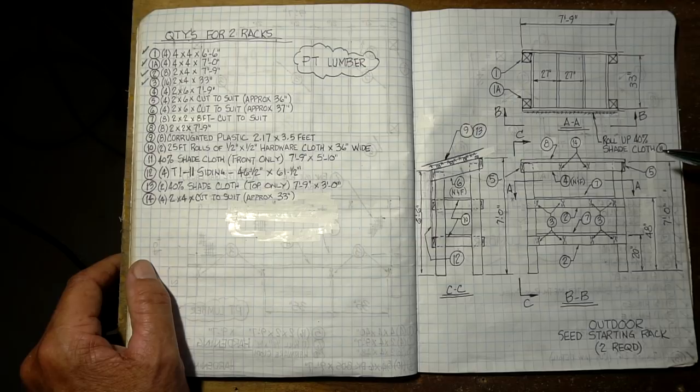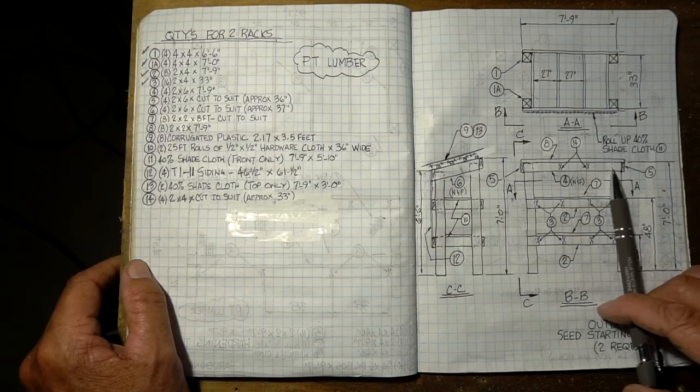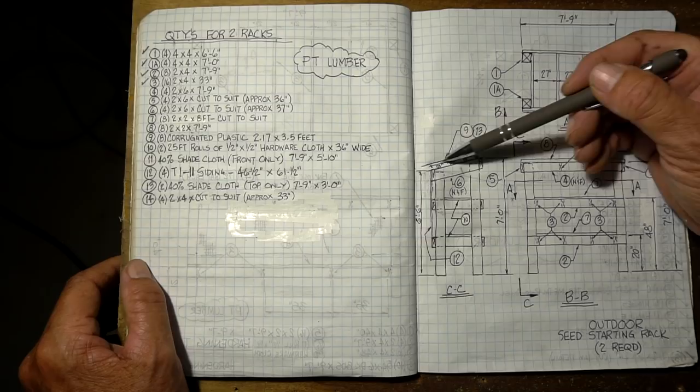Now, when I get out to the area out there and build the roof, I'm going to use a 2x6 frame around the band of the outside of the roof, around the outside edge. I'll frame it in with a 2x6, and then I'll use 2x4 intercostal pieces inside to support the top that I'm going to be putting on.